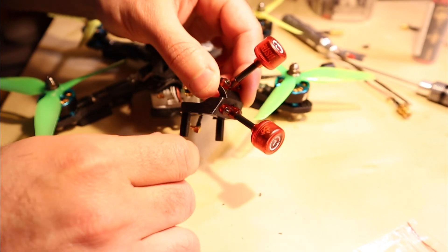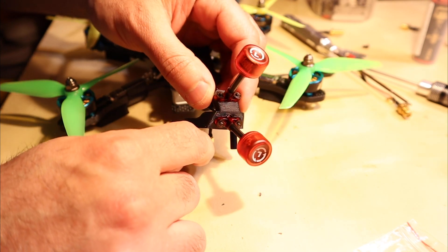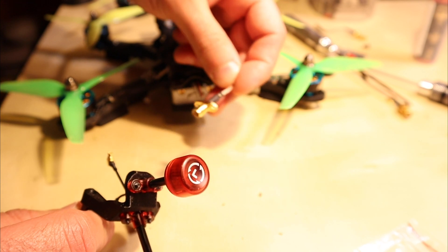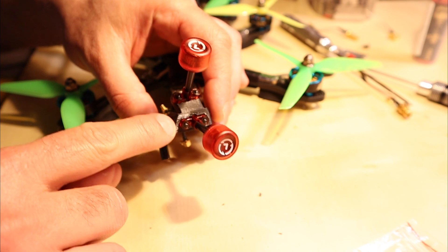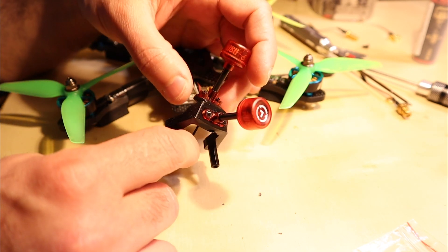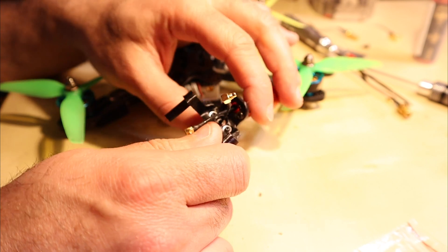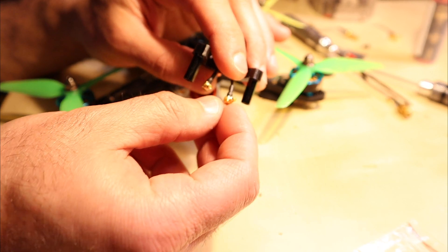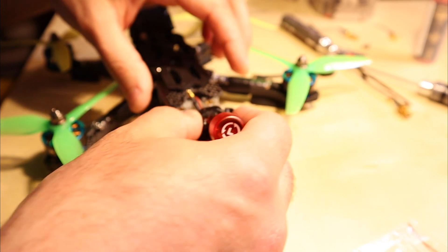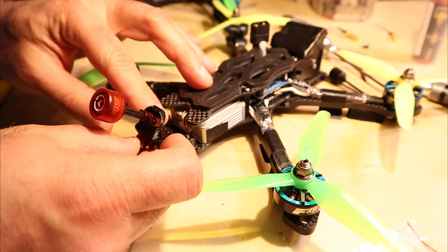So check this out — I finished the little mount. It's all put together. The TPU mount is by Brain3D, based on the Impulse RC design, but designed to work with DJI's SMAs. I actually had to drill the TPU mount to fit this kind of mount, and it wasn't perfectly straight, but it compresses the TPU to the point where it bends the plastic slightly, which makes it hold the antenna really tight. I might put some hot glue in there but I don't think it's necessary.